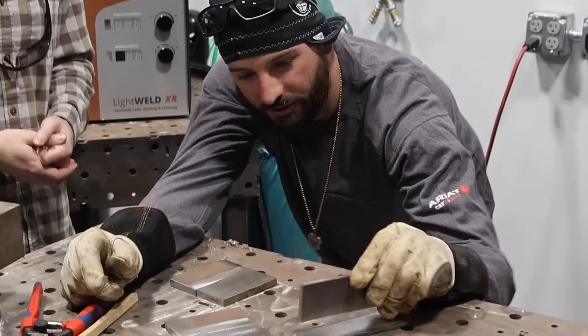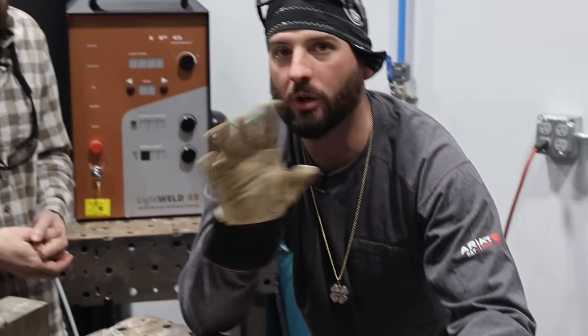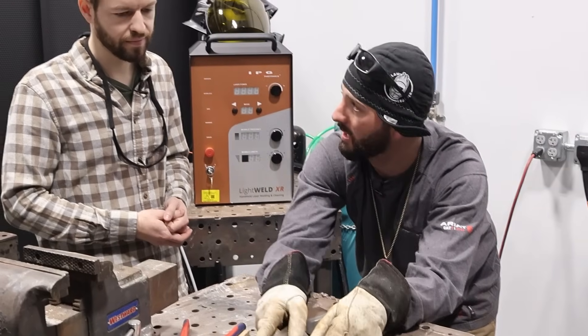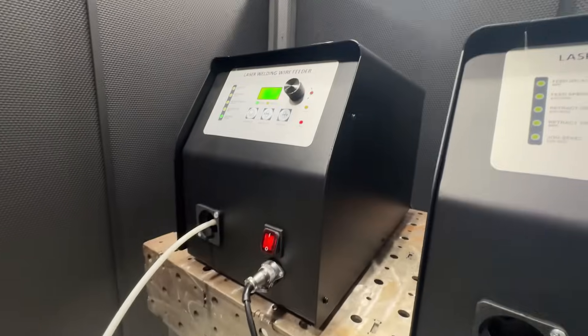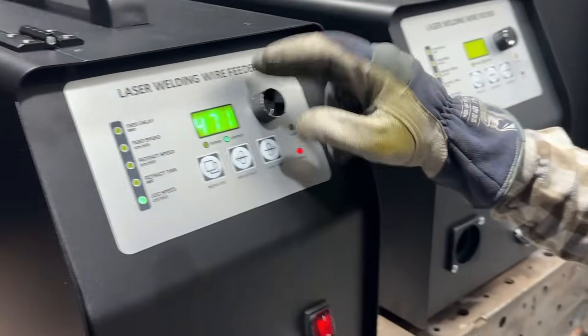When it comes to this quarter inch fillet weld, I'm going to do the MIG welding on one side and you're going to do the laser on the other. We're going to let everything cool off in between so there's no discrepancies, and of course we have our three-eighths plates for a straight butt weld welded on both sides with both processes. One of the comments we got was using a dual wire feeder to get proper reinforcement for the laser weld to compare it to the MIG weld. However, we've got to think about application — we're trying to get a well-penetrated weld without the large weld size. It really depends on your customer specifications — some customers will want that large fillet, some won't care.